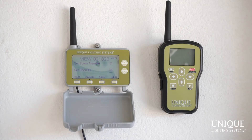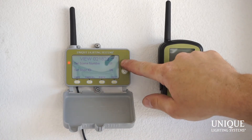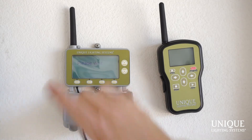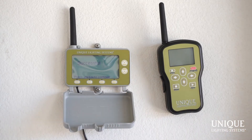The short ID number is simply an ID you attach to this LPCU — it's for reference only; you don't ever need it for programming. I like to use the last two digits of the serial number. Here where it says view 021823, that's the serial number, so I'm going to use number 23 for my ID number. Hold the button and it scrolls quickly — so 23 — and hit save. It says please wait; this is telling the LPCU it's scene number one and ID number 23. It says successful — I've just created a link between the programmer and the LPCU module.